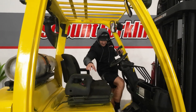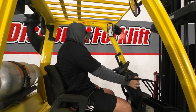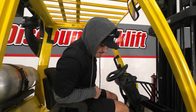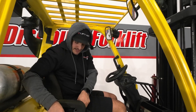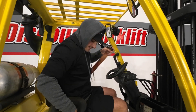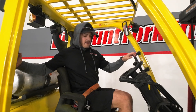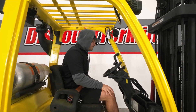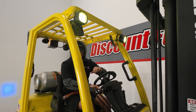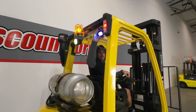Let me hop on this machine to show you the different functions. The key switch is over here on the right. We've got the parking brake on the left. Anytime you're not operating the forklift, make sure to have that parking brake engaged so you're not going to roll — always stay safe. We've got a horn on the machine, and also a horn right here on this back handle, so if you're backing up you can use the horn without taking your hands off the wheel. Lights in the front — there's a button for the front lights, a button for the rear lights, and you have a blue spotter light which helps you see where you're going within your area.